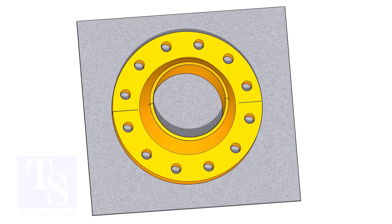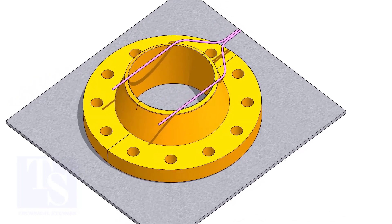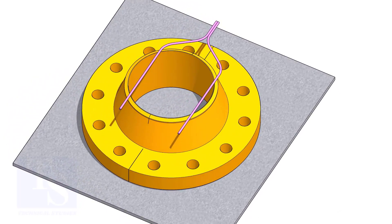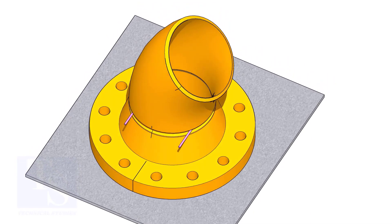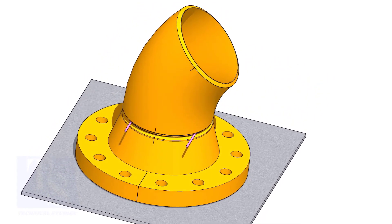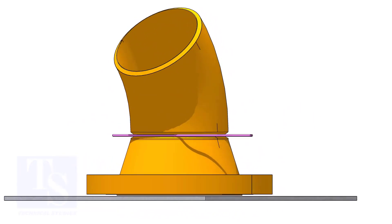Put the flange on a straight plate. Put the gap rod and the elbow on it. Match the center lines of the elbow and the flange. Check the gap and the overlap — if correct, tack weld as per the shown sequence.